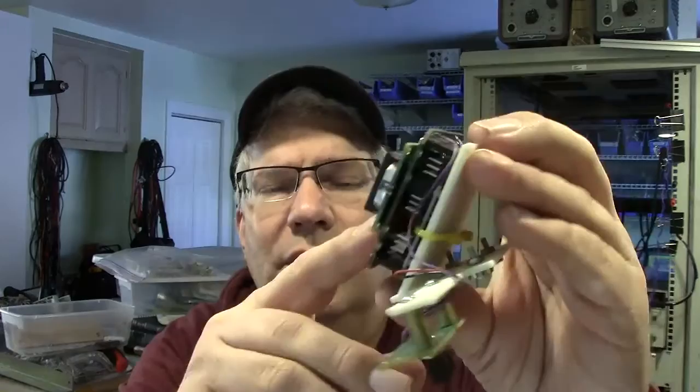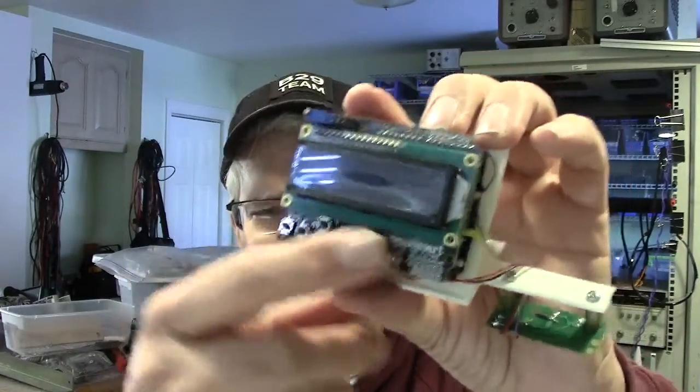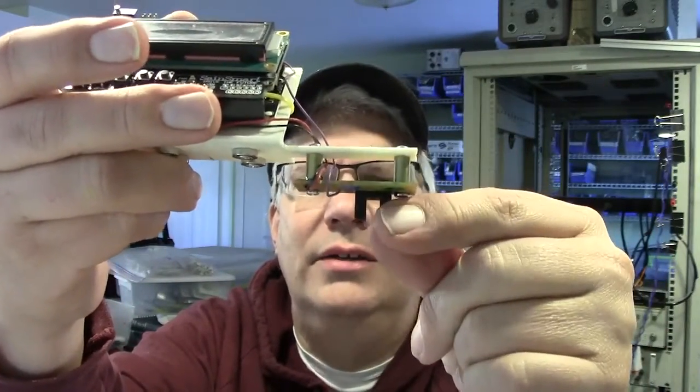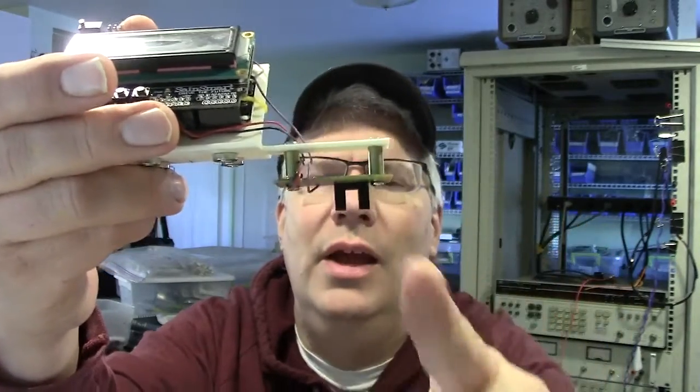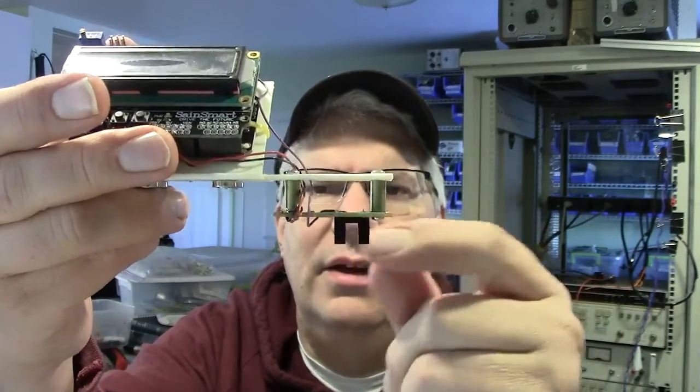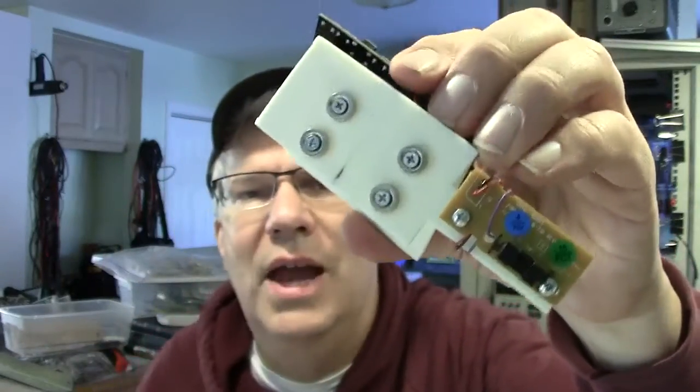A lot of people just spin the wire up on a handheld drill — that could work. I do have a lathe in the garage, so I put a variac on it to get the motor spinning pretty slow. I also made this little counter with an Arduino, a smart LCD screen, and some buttons. Over here is an opto-interrupter, and the spindle I 3D printed to hold the bobbin has indexing teeth on it to count rotations. There are some magnets so the whole thing just attaches right onto the lathe.